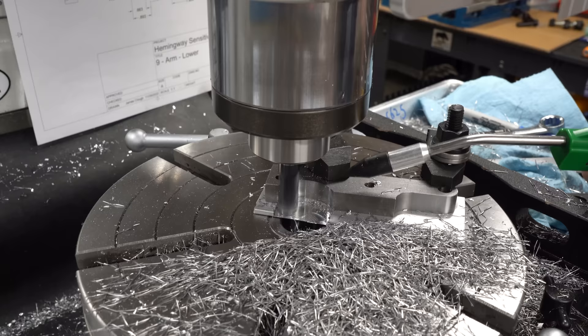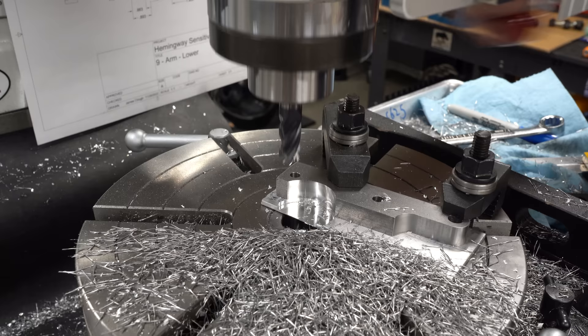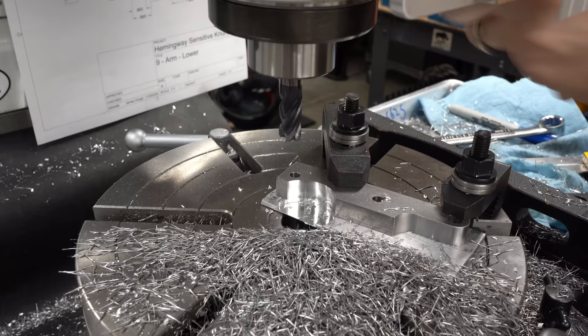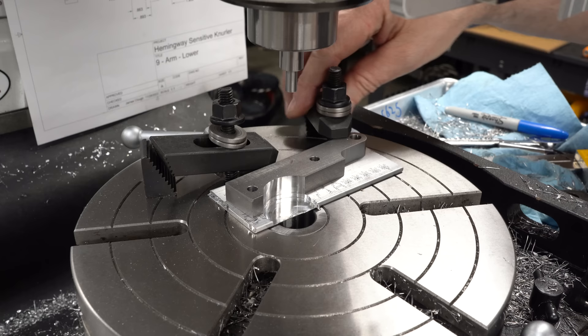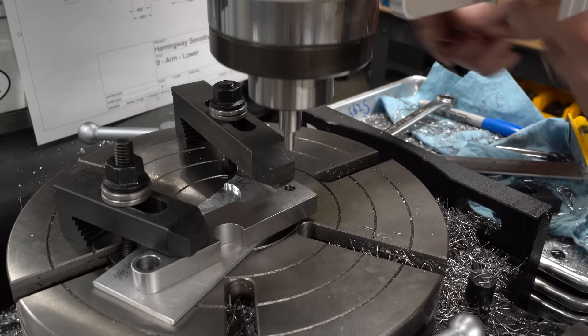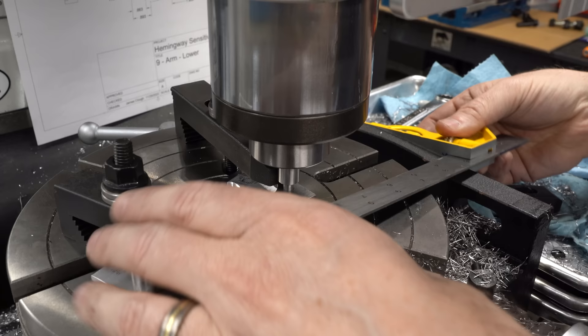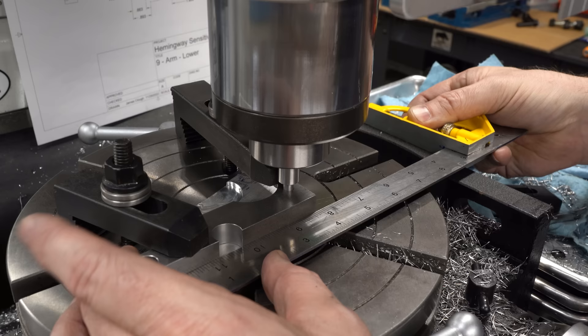There really aren't a lot of coatings that work with both aluminum and steel. I came back after the last pass and tried a climb cut to see if it would change the surface finish, but it was already fine — this end mill is just doing a beautiful job. The welded chips do just knock off; they're not really solidly welded. Once again the surface finish is wonderful. To cut the convex side of the arm I've flipped the part around so the cut side is toward me, and offset right and down the distance between the hole in the end of the part and the theoretical center of the curve, so the center of the curve aligns with the axis of the rotary table.